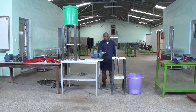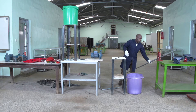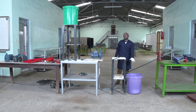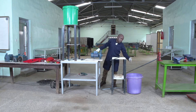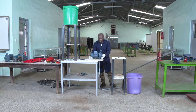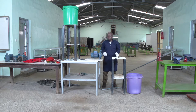Remember, here it is on the direction of the suction side. We are having the tank on the suction side, and we are having another tank where we are going to lift our water. We are supposed to move water from here up to the pump, then the pump gives the pressure and flow. Remember that our pump can give 120 liters per minute — this is the maximum flow rate.